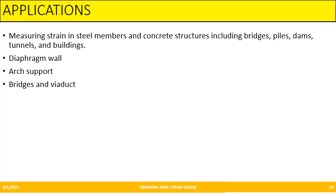To summarize: strain gauge is used to measure strain, and here we are indirectly measuring stress, where stress equals strain into modulus of elasticity. Vibrating Wire Strain Gauge is used in steel and concrete structures and is mainly available in three models — arc weldable, spot weldable, and embedment in concrete. The principle is that whenever a tensioned wire is plucked, it vibrates at a frequency directly proportional to strain in the wire. Thank you.